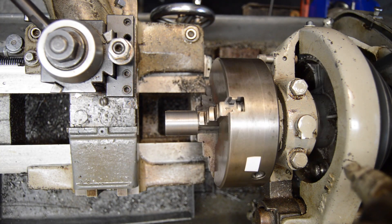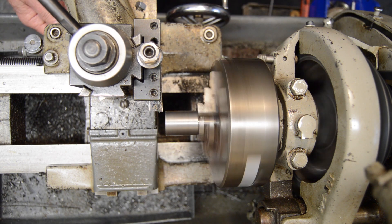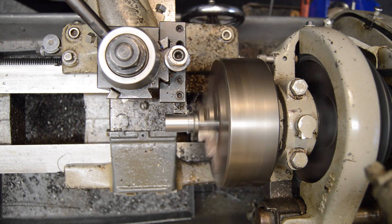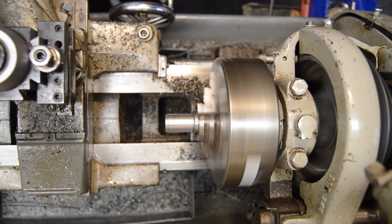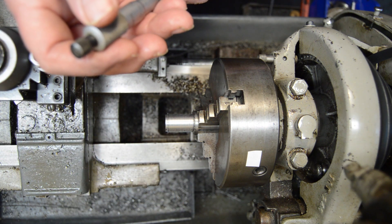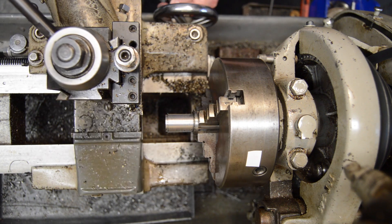Go back and take it down one speed for the first couple of cuts. I want 625 — maybe 650 — 650 will be good on this. Right now we're at 645. That's 644, close enough. It's going to finish at 625 and it's going to be cut into a hex, so let's just go ahead and rough this in.